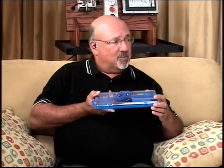So we sell these in kits, and we also sell the ferrules like we do the other ring and butt terminals and fork terminals. We sell them in separate packages, and they're color-coded for different sizes. Those are nice because, like you said, we used to always have to tin the wires, and you got to lug around the soldering iron, and sometimes that can be messy. Find a place to plug it in, or burn myself. I'm real prone to hurting myself.